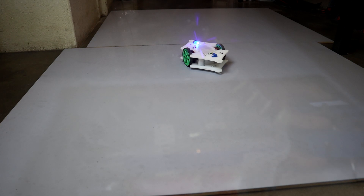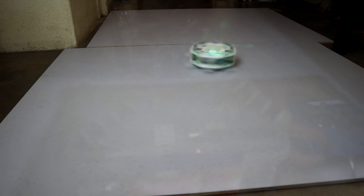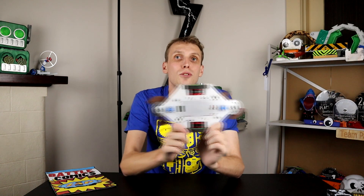Melty brains are a revolution, quite literally. They spin the entire robot around at very high speeds, typically over 1,000 RPM, but usually up to about 2,000 RPM. And while spinning at these high speeds, the motors can be turned on and off at just the right timing to get the whole robot to translate around the arena. This translation is not locked to forwards or backwards because while spinning, forwards and backwards don't exist, so the robot is able to translate any which way it likes around the arena.